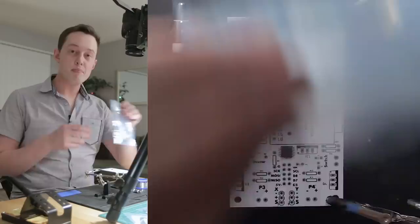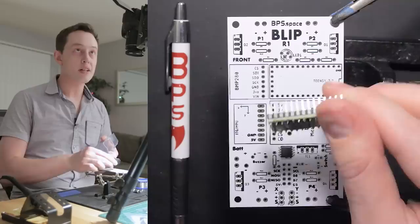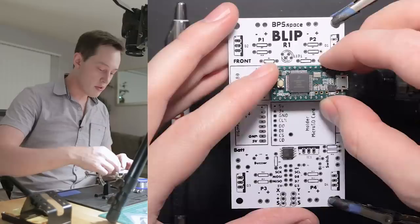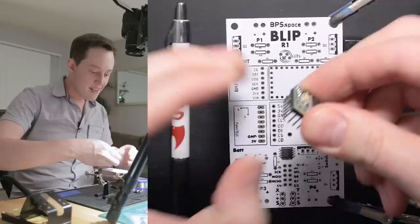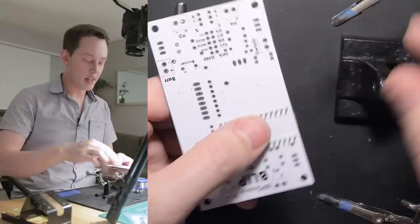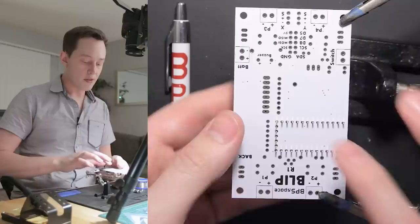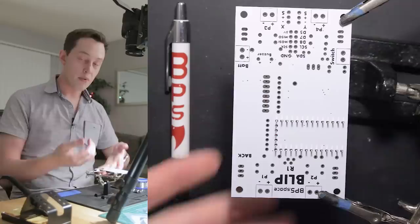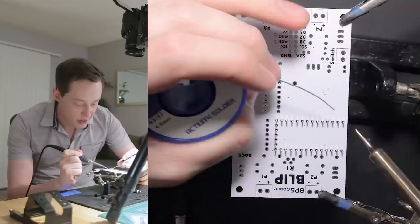For this next step, I'm going to be using the Teensy microcontroller and applying that to our Blip PCB. I've got a couple of them here with header pins already soldered onto the board. This is going to be the brains of our rocket — the processor, the memory, and where all of our software goes. Physically speaking, it's going to sit right here on our PCB, and it fits quite well because we had a good library when we designed this. To actually solder this, I'll turn the PCB upside down and expose these pins on the bottom. There are enough pins that there's decent friction, so this piece won't actually fall off. Sometimes you'll need a piece of tape to hold it on the other side while you actually solder it.